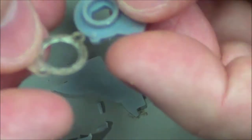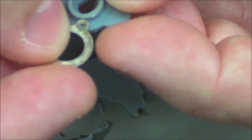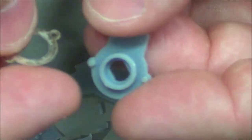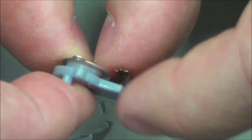Pins look a little fat too, so I'll bring those in also. Or I'm wondering if there's two different sizes here. Okay, so I'll bring the pins in a little bit, not by much. And this is trial and error, because I don't have a working original to test this off of. But you can see, I pretty much got things to tolerance and size, and then I can fix that little bit that didn't print over here and try it again. So it's getting there.